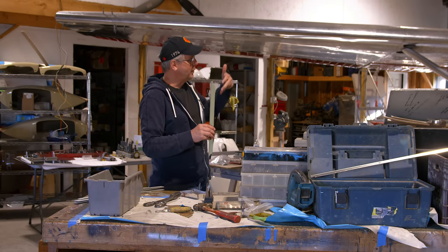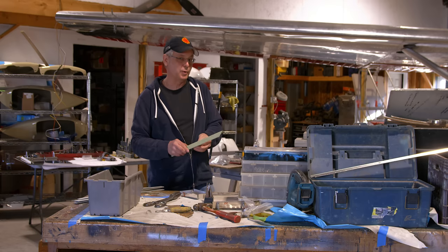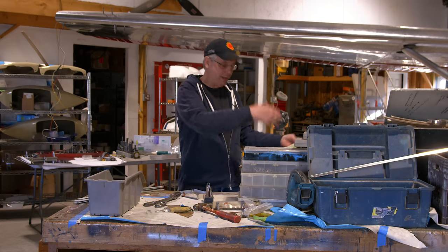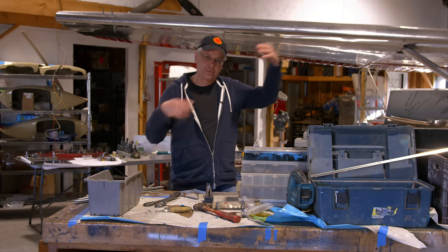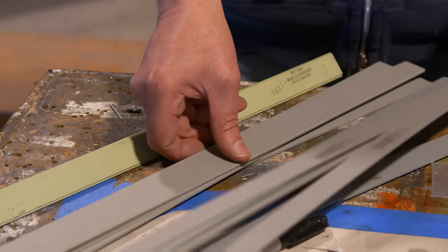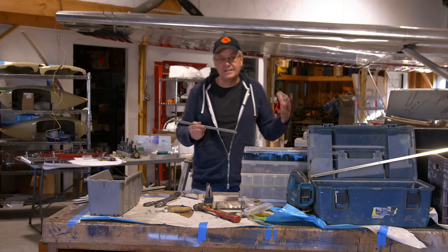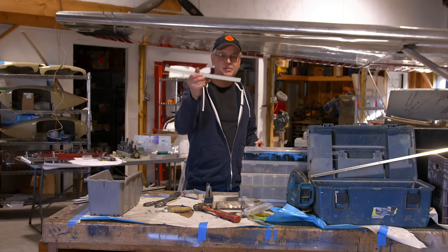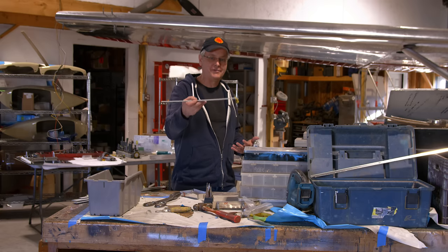And so WingX has done extensive studies and tests on loading the wing and seeing where the stress points are, seeing where the natural fail points are in the wing. And then you add these straps into various places. As we go through the installation, we'll talk about where these straps go. This is a stainless steel strap that goes in here somewhere. Not every aircraft needs to have it because some of the later model Cessnas come with this strap already included in the wing. This is an early model Cessna, it doesn't have it, so we have to add this strap.